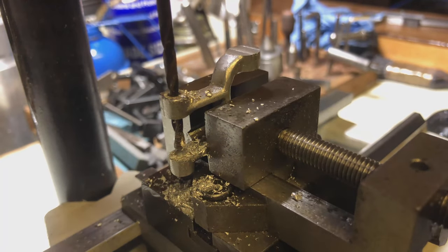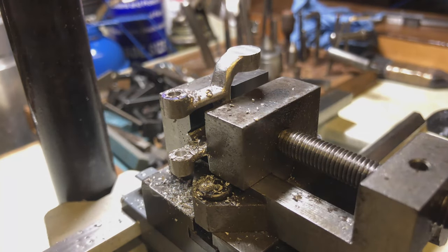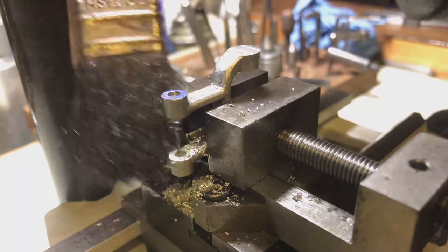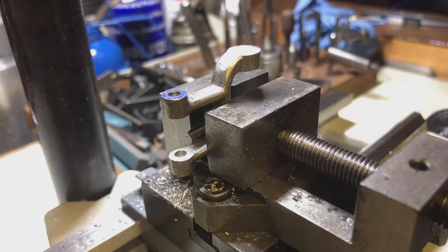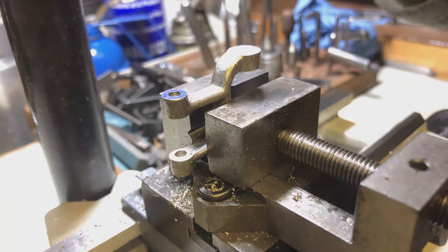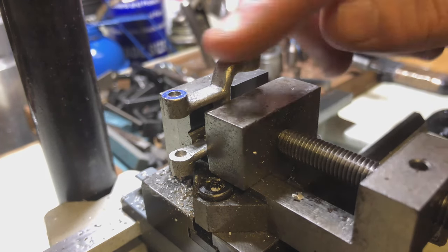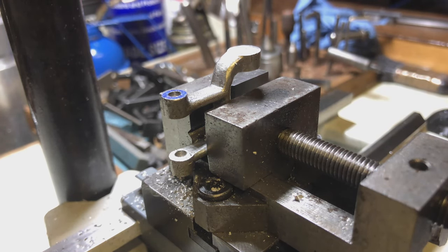Make sure it's pushed over to the location feature, and now once again it's perfectly in line. Beautiful — truly beautiful. Let's give this a shot. And through it goes — there we go, just like that. Both of those should be perfectly in line. Okay, the bottom one — the casting is not even, which is a little frustrating, but they are both in line, which is the main aim of the game. They have to be perfectly in line with each other. Very nice — now I've just got to do the big rear boss and then it's done.